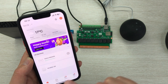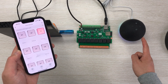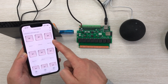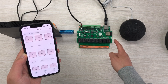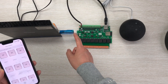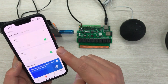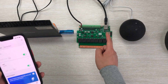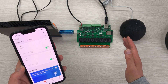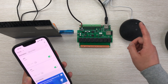Let's test the second automation. I click the voice module and watch the relay. I say: 'Alexa, turn off switch 9.' — Okay. You can see switch 9 is off and relay 1 is off. So you can use this voice module and connect it anywhere that has a Wi-Fi signal, and it will communicate with your load. Using the Tuya mobile phone application Scene mode, you can link this module to any other Tuya device — not only KingKong relay boards, but also any other Tuya product — making it smart with voice control by Alexa or Google Home.